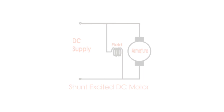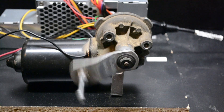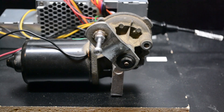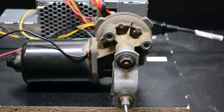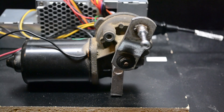How does that work? In the case of a motor, when we apply power, the motor turns — that's kind of what its job is. However, with a motor, when we take the power off, the collapsing magnetic fields generate an electrical current as well, but in the opposite direction to which we applied it. So now, if we short the ends of the motor out, what happens to that power? It gets jolted back into the motor, in reverse, and the motor basically comes to a screeching halt, almost instantaneously.